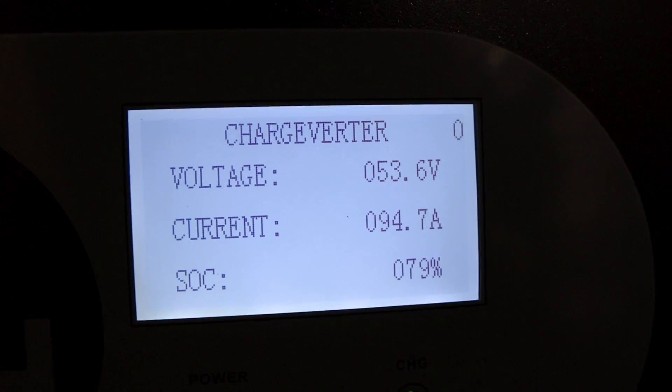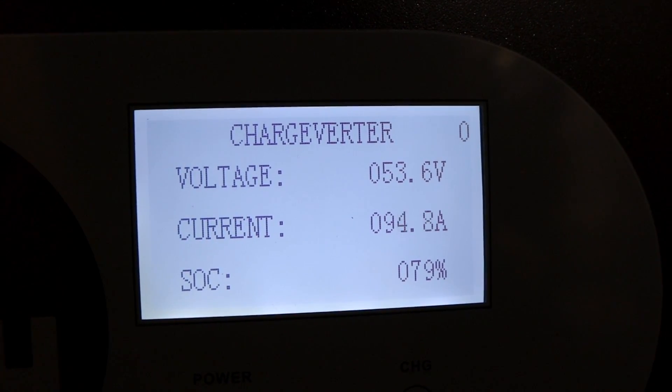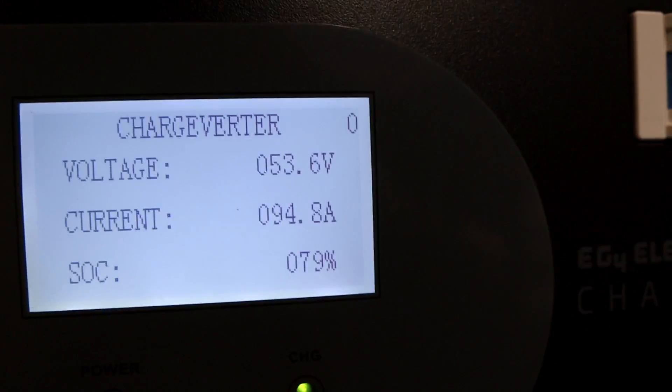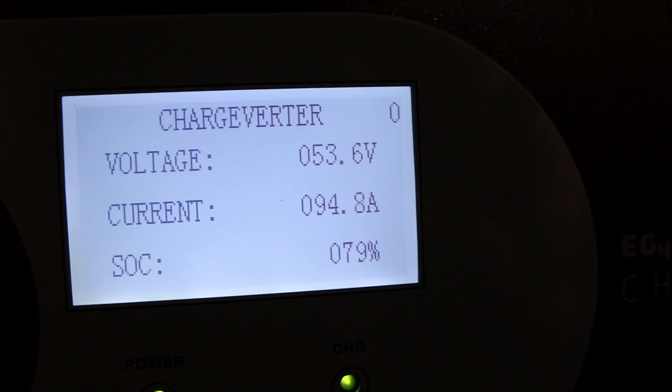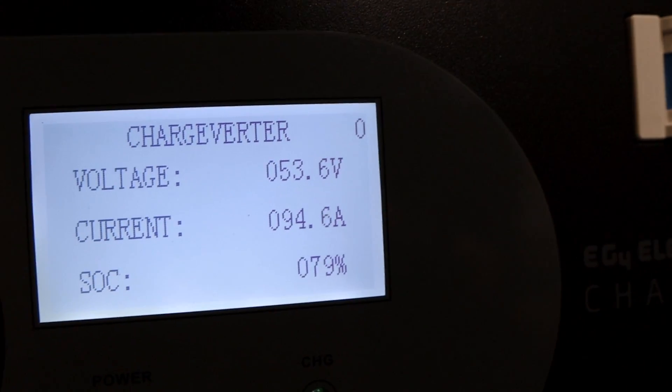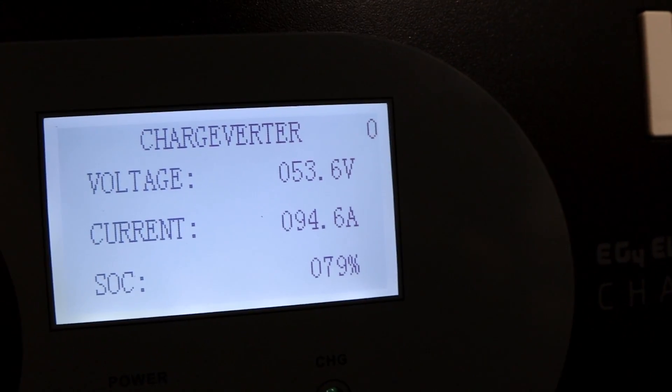It's not going all the way to 100 amps, sitting at 95. Maybe if the SOC were lower it would hit 100 — it might be holding back because it's only communicating with one battery out of the full bank and doesn't want to overload the BMS. So what do you think about the ChargeVerter so far? I still need to do some wire management and clean things up. If you want one of these I'll have it linked down below — it's got great features including SOC-based start/stop and generator auto-start. I haven't tested the generator auto-start yet since I don't have one with auto-start capability, but I'll test that in the future. If you like this kind of video, hit that subscribe button, hit the like button, and thanks for watching.